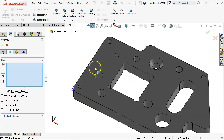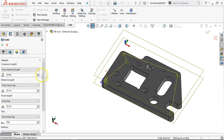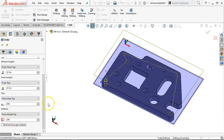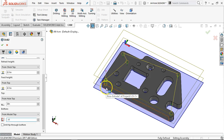I want to go with the cylinder again so it finds all the same-size holes. We're still maneuvering around clamps. But instead of from hole bottom, I'm going to go from model top. We'll turn off breakthrough since I set that as my default. Instead of worrying about chip backup — standard spiral point is going to push the chip ahead into the bottom — I'm going to say we're going to take the zip gun, hand drill, and finish-drill this. So if I go to minus 0.4 from the top of the part, the chips aren't going to be crammed into the bottom of the hole. It found the tapping cycle — go ahead and accept.